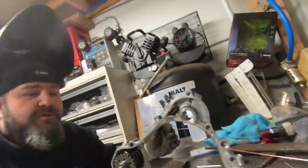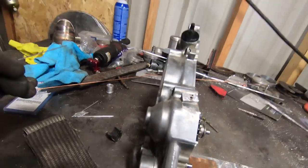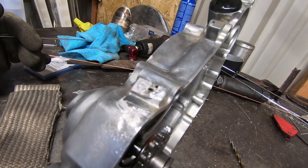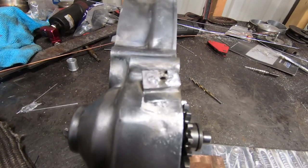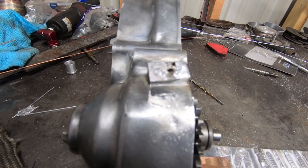So here's exactly what I was talking about. So you see all that garbage? There is a ton of crap coming out of there. You got all kinds of pock marks. You got a little black mark that popped out of there. That's all impurities that are in the casting. So we need to get all of that out before we can start adding filler material.